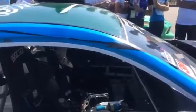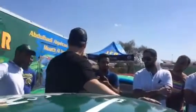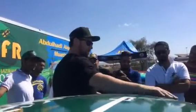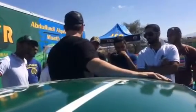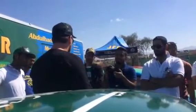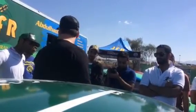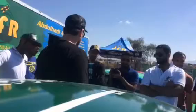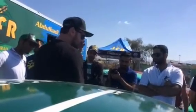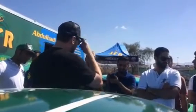Anyone have any questions? I own drift. I've done some racing. This car could be used for racing. It's just a different setup. This car has fully adjustable shocks. So if you were going road racing, you would change the sway bars, the shocks, maybe the springs. Right now on the racetrack, it would understeer the way that it's set up. But it's very easy to change the balance of the car to make it work for that.